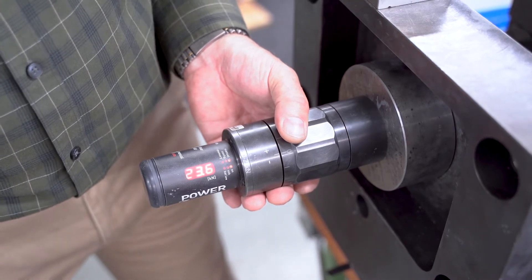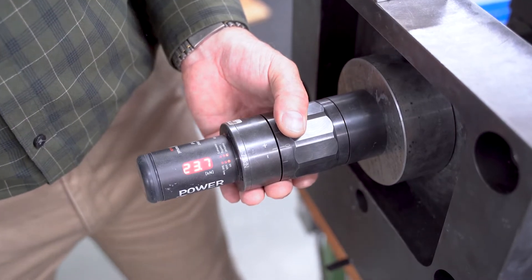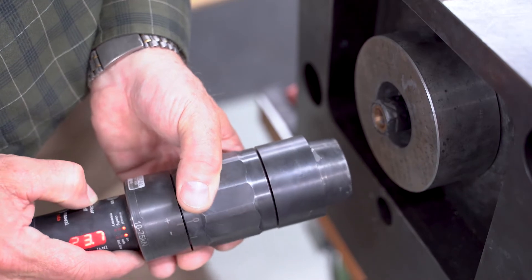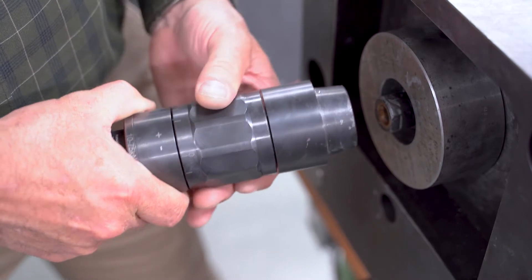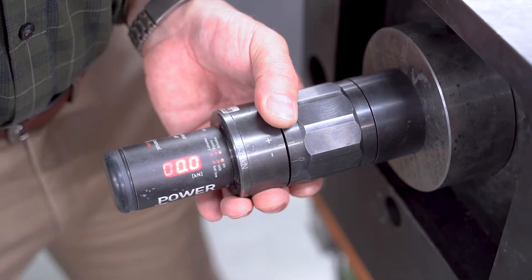So that's actually really good because standard is 18 kilonewtons on an HSK 63A drawbar. Now we're going to unclamp it, zero it out again — okay, it's zero. Now let's set the tolerance range — we go plus 0.1 millimeters.